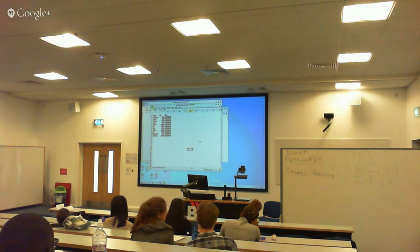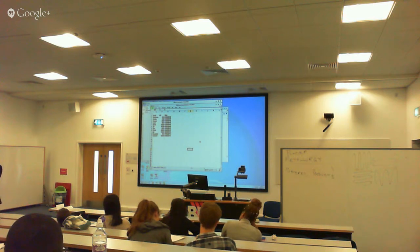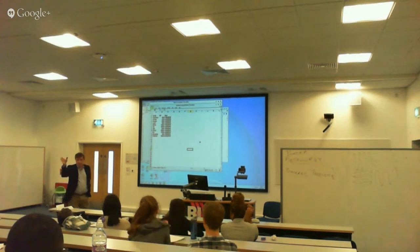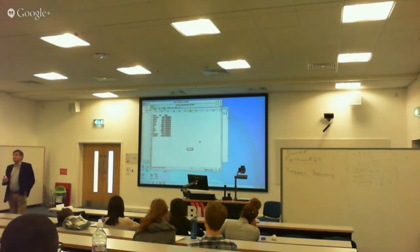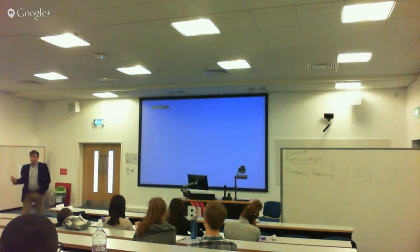Aluminium failed miserably because it oxidizes. By oxidizes, I don't mean rust, but it oxidizes. And when it oxidizes, the compaction doesn't hold and the bits don't stay together if you eject them. Steel, perfect. But having said that, they do it in industry on aluminium in a controlled atmosphere so there is no oxidation, unlike the way I've been doing it. Anyway, almost all metals can be done, as long as we keep them in powder, which you can.